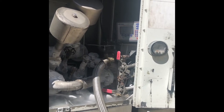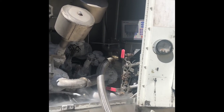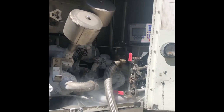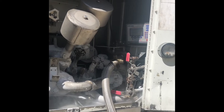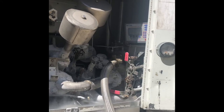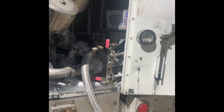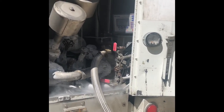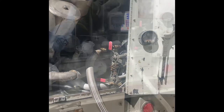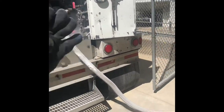That's the process that we do, because it's going to let us know when the pump is cooled down, right? In this particular case, we're going to deliver by weight, so we don't need to snap a picture of the meter or anything. But we still need the meter on to make everything work and to let us know when the pump is cooled and we're ready to go. So at this point, as I'm purging, I'm going to go ahead and get my tablet and scan the barcode real quick. Now we're getting some gas out there. Take a look, as everything's frosted up.